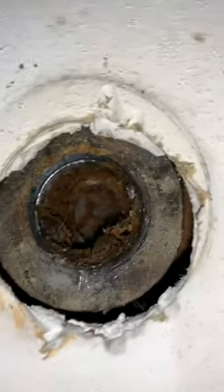So now what I'm left with is this 1959 cast iron fitting. And because it's been together so long, I need to clean it. What I'm going to use to clean it is a wire brush. I have that around here somewhere, but basically I will just go around and scrape out the fitting. And then the fitting should be clean for when I screw in my PVC.